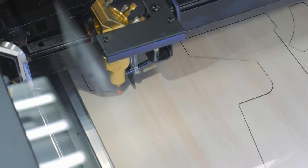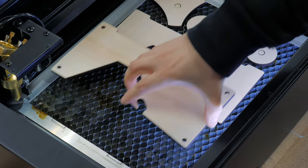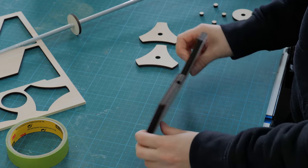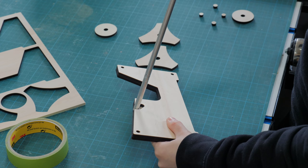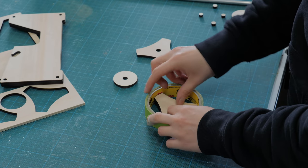So I cancelled the job and then created my own preset to use in the future with the same plywood. It all depends on the density of the wood and I believe that cutting a hardwood would probably need that second pass, but in my case it wasn't necessary. When I was analyzing the first test, I noticed that I forgot the holes on the outer face of the tape dispenser, but regarding the machine performance, everything is looking sharp. The 8mm rod fits nicely in the slot and the middle holes of the smaller components also fit well in the rod.